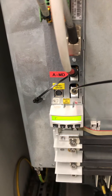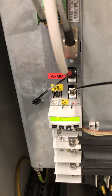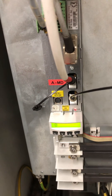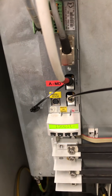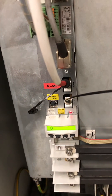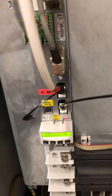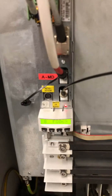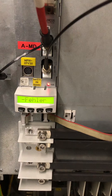But what about the case where 24 volts has been sent but yet still there is this alarm? What happens is that the drive accepts 24 volts DC control voltage and then converts it to 15 volts DC voltage to communicate with other drives. The 15 volts DC communication lines run through these bus lines.